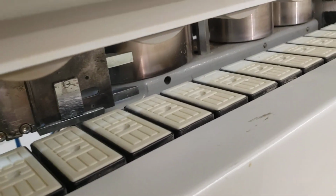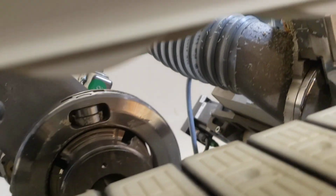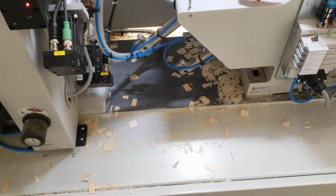The next step of the daily cleaning that you do at the end of every day is you just take a quick look at your cutting heads, make sure your end trims are nice and clean, there's no obstructions, no buildup of parts in there. There's no major gunk or anything. Usually at the end of the week I'll do a good clean on all my cutter heads, and you just do a visual check here on the day-to-day.